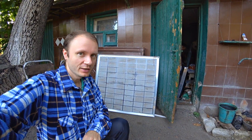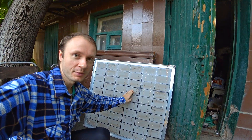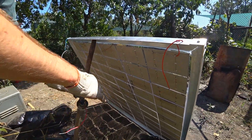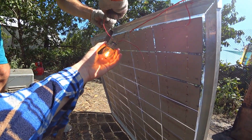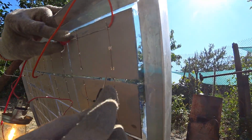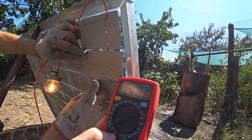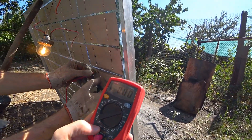When the elements are glued and soldered, it is necessary to test the solar panel. Because if a single element is not working for some reason, then the whole panel is going to be useless. To carry out the test, we're going to expose the solar panel to the sun and check each element whether it works. I'm using a bulb for this — the blinking light will show me the defective element and where there is unstable voltage. We have a high chance to find some defective elements because we used the damaged cells. Turning it on — and now we see 0.43V. That is fine. Next, the same: 0.41V. It's good, I give it an A mark. The next one is 0.40V. These are good.